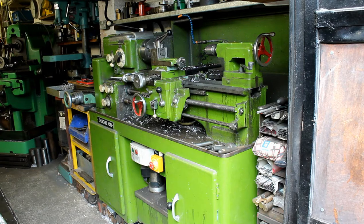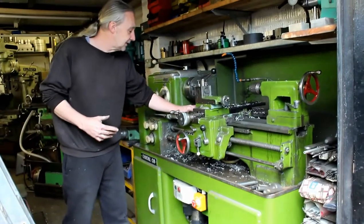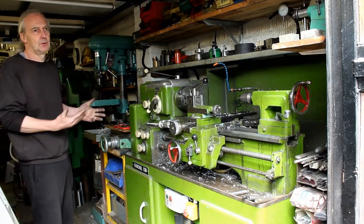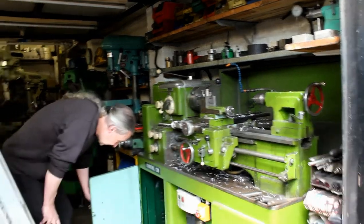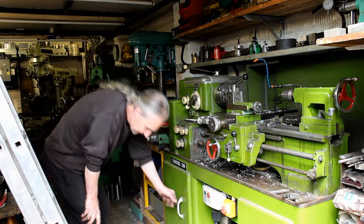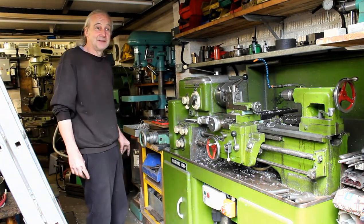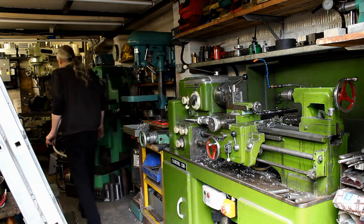This Churchill Cub has had loads of work done on it. If you put a lot of power on it the motor gets very hot - it's working but the motor is probably on its way out. It's a big two horsepower motor. You can smell an electrical smell. I've got another motor down here but no time to fit it - you can spend a few days on it and then find out the bracket doesn't line up or there are other problems.